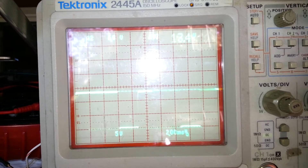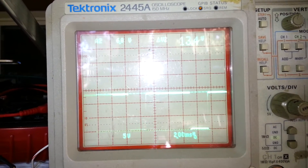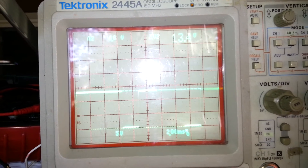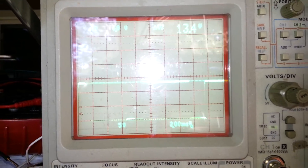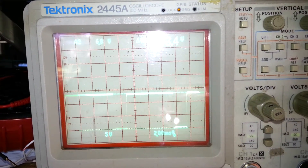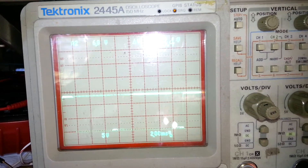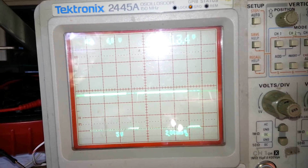You can see the PWM slowly — the pulse width is growing as the temperature cools off, and at some point the pulse width will be narrow, or large enough that the gap is narrow enough that the fan shuts off altogether.